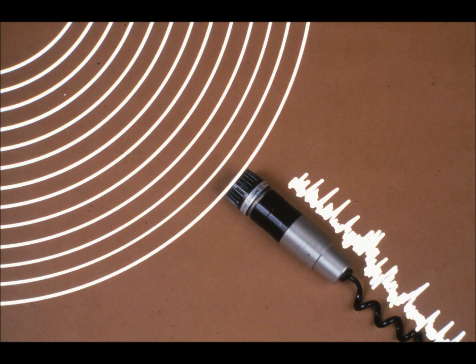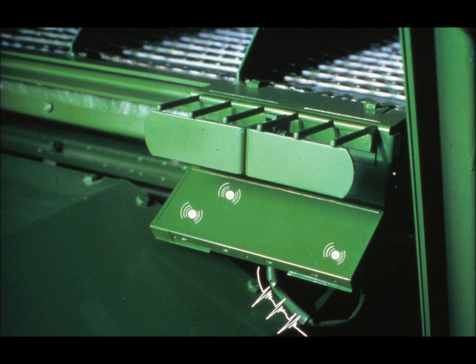All four sensors are identical in operation and work on the same principle as a microphone. Sound waves vibrate a pad that surrounds an electromagnet, changing the waves into voltage signals. In the Harvest Track system, grains act like sound waves, striking the sensor and generating a signal. Instead of a vibrating pad, a centrally mounted crystal detects the striking grain, producing a signal of a few millivolts.